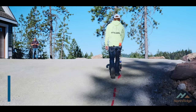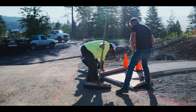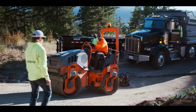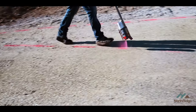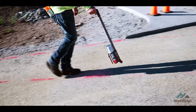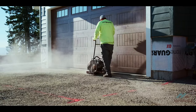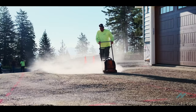Thursday, 9 a.m., we're back at the Spire Ridge site, and today we're going to put in the driveway. Black Diamond Asphalt is mobilizing their paving crew today — asphalt goes down and we'll have a driveway by the end of the day. There's still prep work to do: draw out exactly where the driveway parameters are going to be so the paving machine operator knows what paves and what doesn't. We also need to make sure any loose spots from truck traffic since the grading crew were here get compacted tight with no issues.